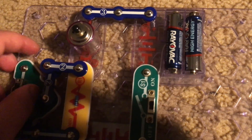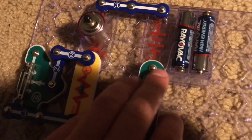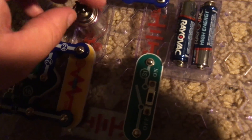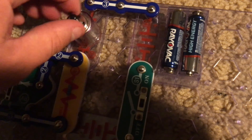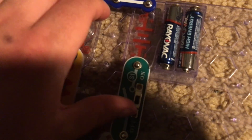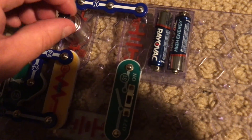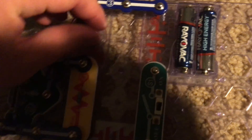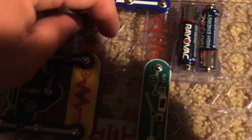If that doesn't work, you may have to replace the batteries. Now we're going to turn off the slide switch and turn the motor shaft counterclockwise with fingers. It's pretty easy to do so when the switch is off, but now let's try it when the switch is on. Be very careful — don't let go of the motor. See how it's harder to turn it counterclockwise when the switch is on, because the circuit is trying to make the motor spin the opposite direction — clockwise — at the same time.